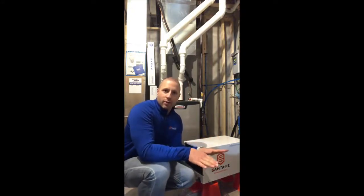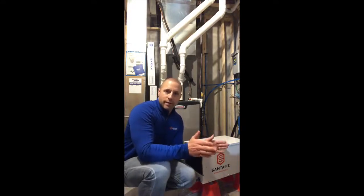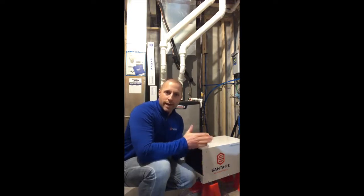So first and foremost, seal up the ground — we don't want any open soil, open sand, open gravel, nothing like that. Seal off those vents, and then you can focus on adding the dehumidifier to that crawlspace. Otherwise you tend to just be spinning your wheels — that dehumidifier is going to run and run and run and really never keep up and maintain your set point in that crawlspace. That's it for today's quick tip; stay tuned for more quick tips from Santa Fe and Ultra by Santa Fe, and until next time, take care.